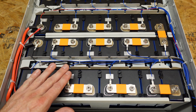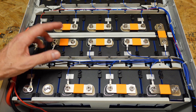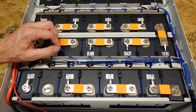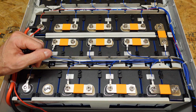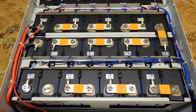That flexibility helps reduce the amount of stress or force exerted on the actual posts of the battery. The leads are routed very nicely up the center of these steel channels, which are also holding the battery in place. The wires are zip tied in place and appear to be high quality wires. One thing I look for is whether companies use wire with very soft insulation that can be easily damaged when zip tied. This wiring feels fairly tough, almost like MTW or machine wire, though I don't see that noted anywhere on it.